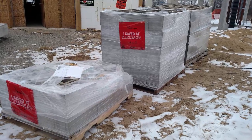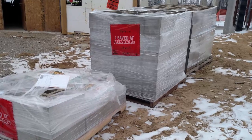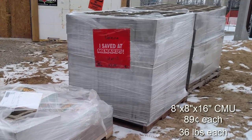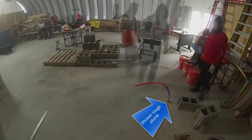For some strange reason I have always wanted to build a block wall. I heard that dry stack was a good solution for amateurs, so I decided to use that approach to build a bathroom in my garage. I ordered three pallets worth of blocks and had them delivered. These are the standard 8x8x16 blocks that cost 89 cents each and weigh 36 pounds. We cleared the area and used a chalk line to mark out the dimensions from my plans.